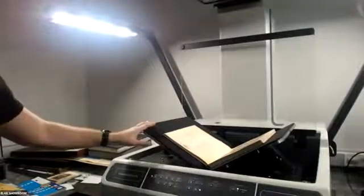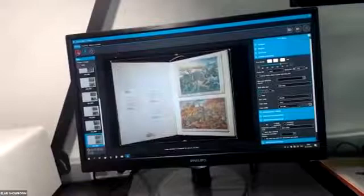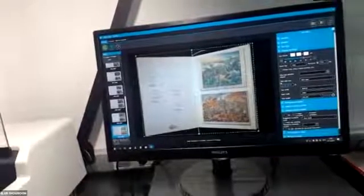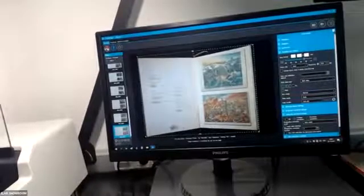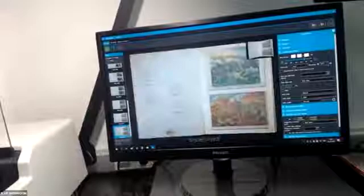The same speed applies in V-shape mode, and we are doing a geometrical correction of V-shape to flat online, while scanning. You know this. We are always demonstrating this: when we turn to V-shape, we just indicate in the software that we are scanning in V-shape mode, and we start to scan with that. We still have the V-shaped image on the screen, but after scanning, it is flat. This is the main specialty of the scanner, its basic specialty.